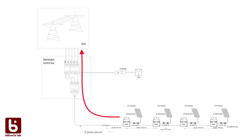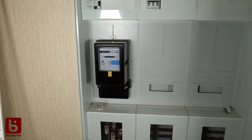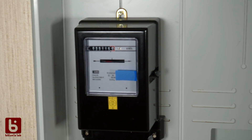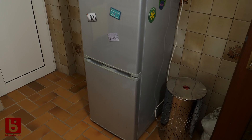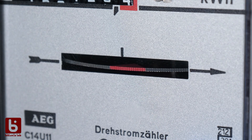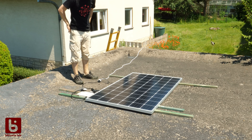There is also the first catch. Typically you are not allowed to feed back to the grid — there are some regulations. Here in Germany you need a smart meter, specific contracts and whatnot. The house where I am living has this old meter that is not suitable to feed back to the grid. But the good news is you are allowed to produce electricity for yourself as long as you ensure it doesn't exceed your consumption at any moment. Since you have always appliances running like your fridge, you have always a consumption of a few hundred watts and this can be easily compensated with one of these panels and a microinverter.